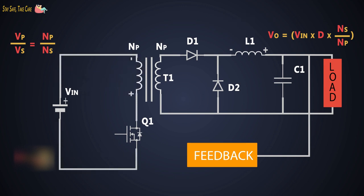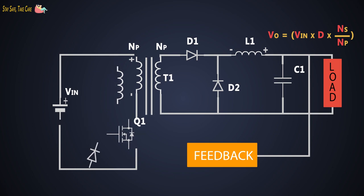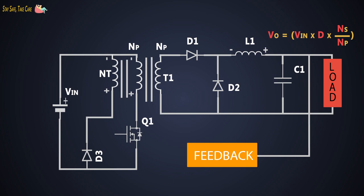To avoid this, we have to reset the transformer after every cycle, where the trapped energy in the transformer will exit and the voltage across the primary side of the transformer should go towards zero. For that, we can add an extra tertiary winding and a series diode. As the polarity of stored magnetization energy of the primary winding is reversed, this will induce voltage in the tertiary winding and this diode will get forward biased, so current through the tertiary winding will start flowing. This winding is very closely coupled to the primary winding of the transformer. This is how the stored energy of the inductor is fed back into the supply itself and resets the transformer. Even when the switch is turned on, voltage will induce in the tertiary winding, but as the diode gets reverse biased, there will be no current flowing through this circuit.